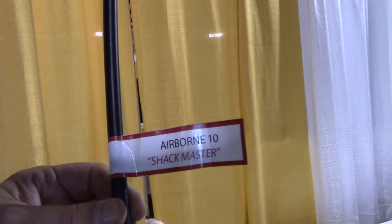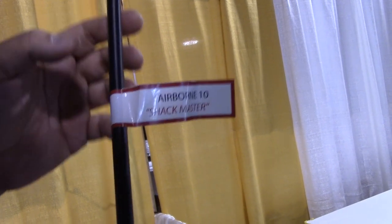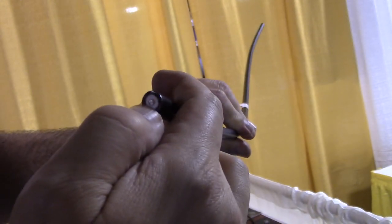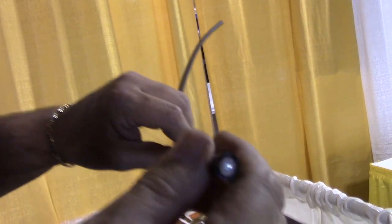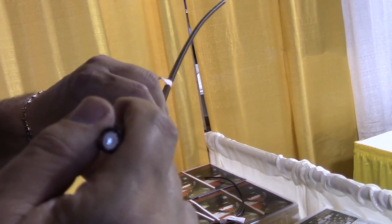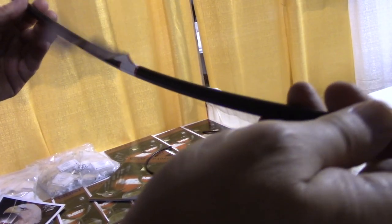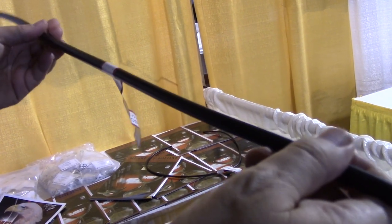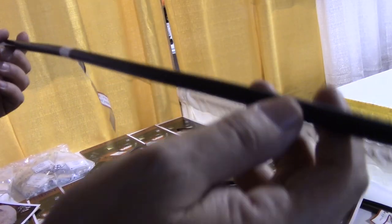This cable, called Jolly, is very similar to LMR-400 in that it has a quality polyethylene jacket instead of PVC so it's UV-stable, and the inner conductor is copper-clad aluminum like LMR-400. The tape is copper and the braid is copper-clad aluminum. The final result is the lightest cable in its class currently on the market, with extremely good attenuation performance and very good screening efficiency.